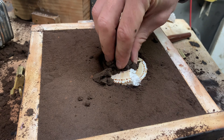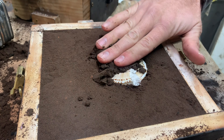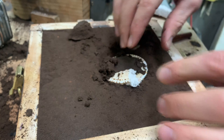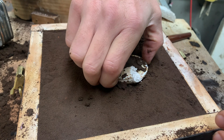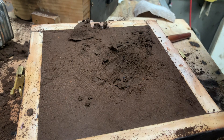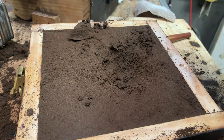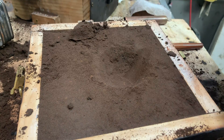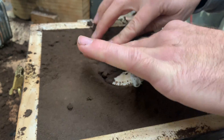I thought I might just have the parting line go completely over the shell, but this turned out not to be the best idea. I need to have an open channel so as the air and gas are vented, they have a place to go. The idea is to create a channel along the outside edge of the shell to the vent hole so everything can escape.